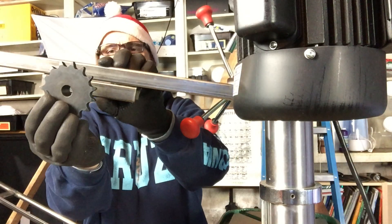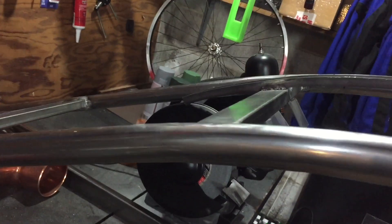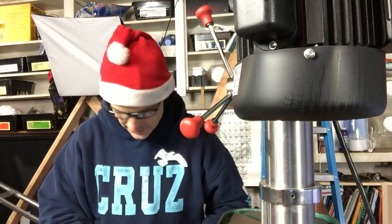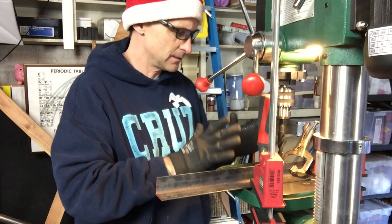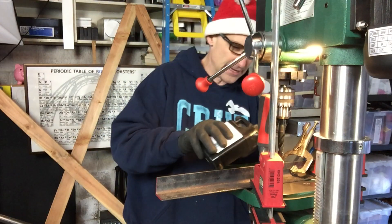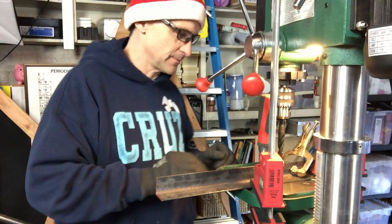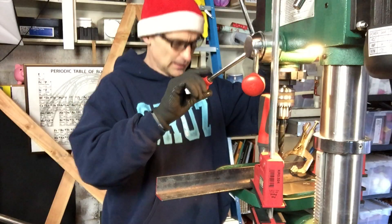Sitting between two of these will be the sprocket system. The sprocket will rest just below the level of the track so that when the chain goes up and over the sprocket, it never touches the chain dog and nothing ever gets tangled up. We want it as close to the track as we can get it but not tangled in the track. I like to clamp the heck out of things when I'm working with the drill press and metal. I also like to use a little bit of cutting oil when I drill through especially thick pieces of metal - I want things as smooth and fluid as possible.